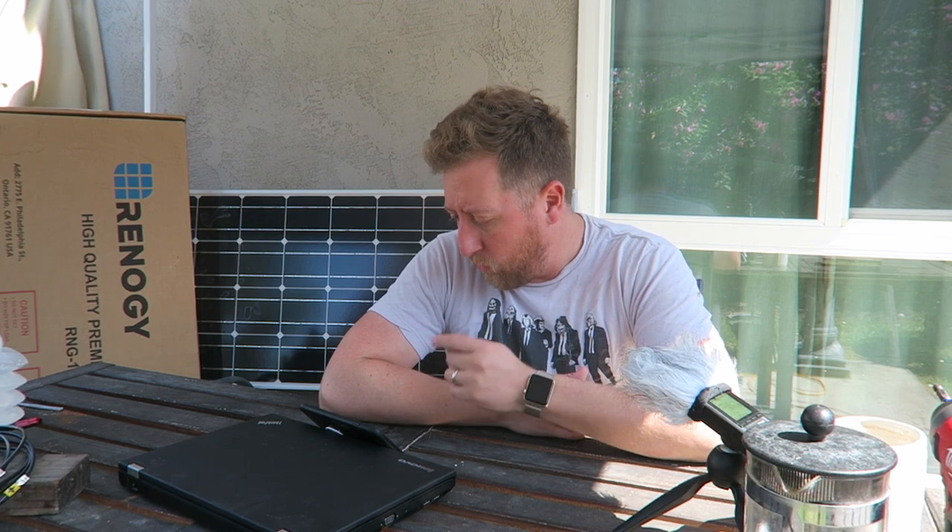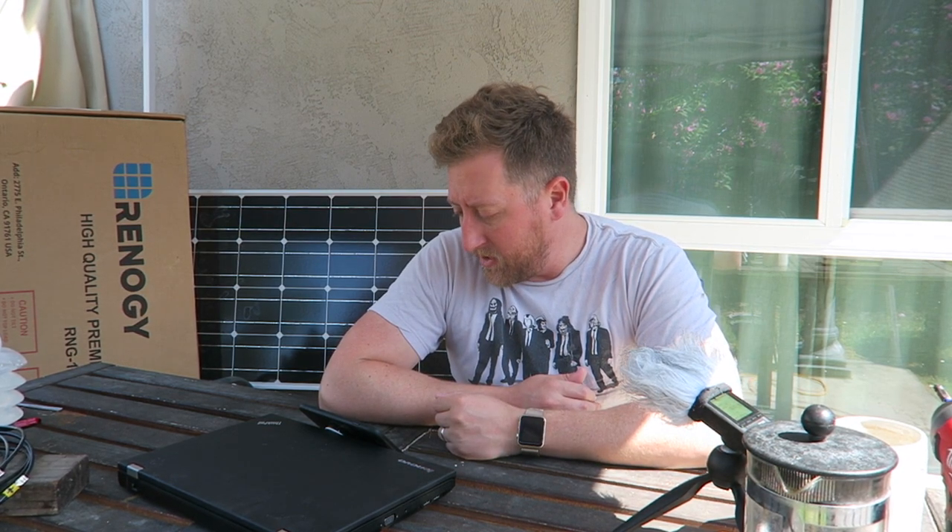I also ran the MFJ 1522 Pulsar, also referred to as the Mighty High Gain. It's about five and a half feet and offers 4.5 to 7.2 dB gain depending on whether you're on VHF or UHF. I can't independently verify those gain numbers — they come directly from MFJ — but I was able to get out pretty far with my 50-watt VHF/UHF radio.